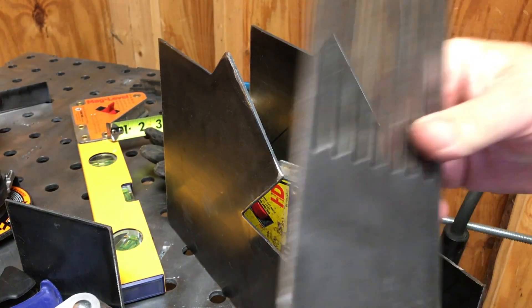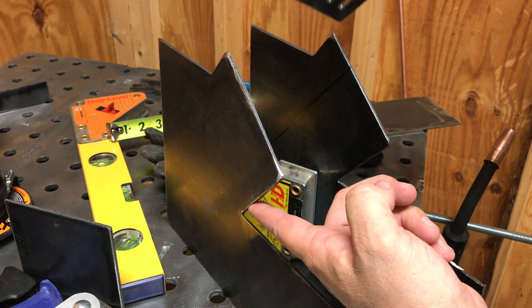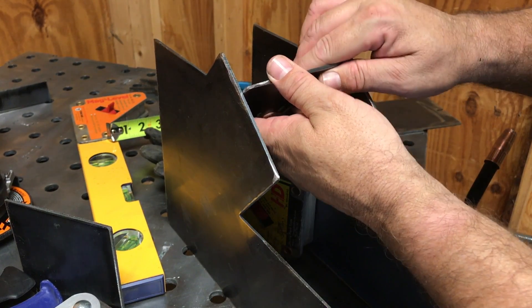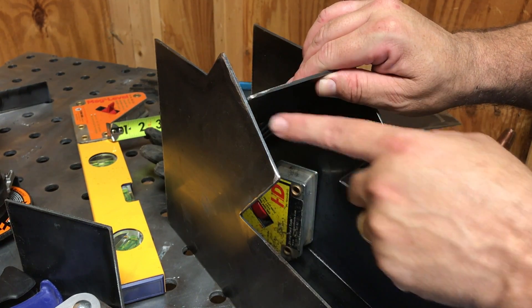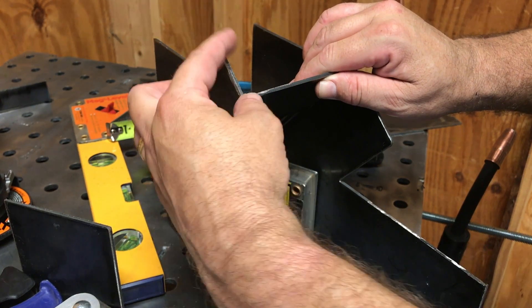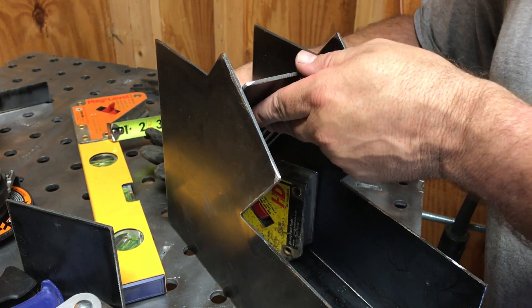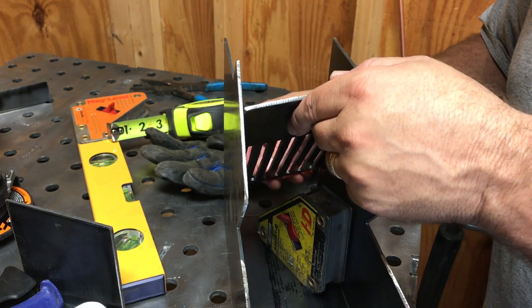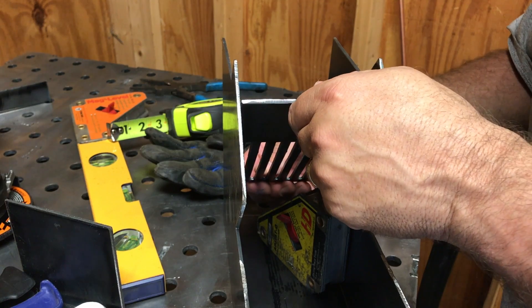I'm about to put this piece in and I'm going to follow the angle here. I'm not going to split the difference exactly 50-50 — I'm going to do about one third down. That leaves plenty of room on the top for wood to go in to feed the fire, and plenty of airflow to go through the bottom. The piece in the center here — this isn't 100% critical — but it's going to leave a gap at the bottom, and that's perfectly fine. No issues with that at all.